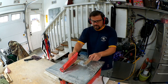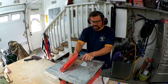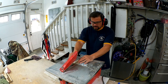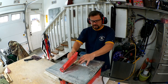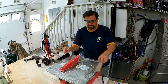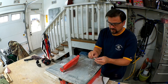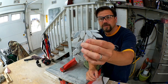Another item I ended up using with these really thin tiles — because they tend to want to bounce around and you can't get good clean cuts — is to take a piece of scrap wood and lay it up against right near the blade, right near where you're going to make the cut, and just hold it down so it's firmly against the table. Now I've got my cut here and you can pull the tape off fairly easily, and you can see the cut is pretty clean for a glass tile.